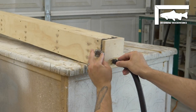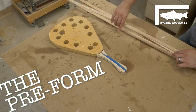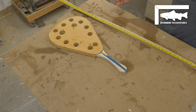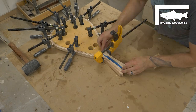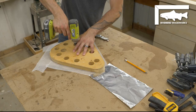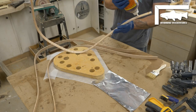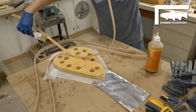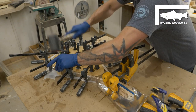With the net hoop material placed in the steamer on little racks, I set my timer — 23 minutes for this one — and we'll be ready to bend on the form to pre-form it. I forgot to mark center, so we marked the center point to align with the form. It's been a couple of hours since I removed the pieces from the steam box, put them into the form, and clamped it. Looking really good. Next step is to pull the clamps off, remove the form, put down wax paper so nothing sticks, then glue and clamp it with gorilla glue.